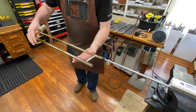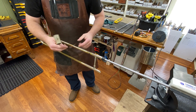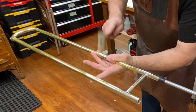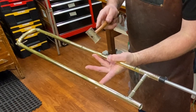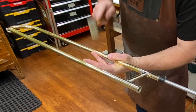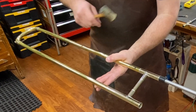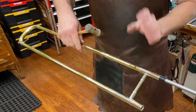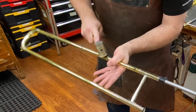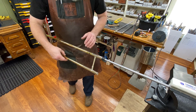I'm going to use a rawhide mallet, and I want to hit the ridges around the dent to soften it. You can hear how good the contact the rawhide mallet is making. By using the rawhide mallet there's no chance of stretching the material. I feel pretty good about that — you can see how much better the slide moves just from that.